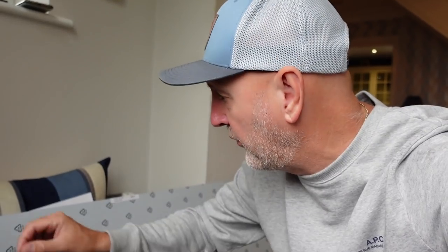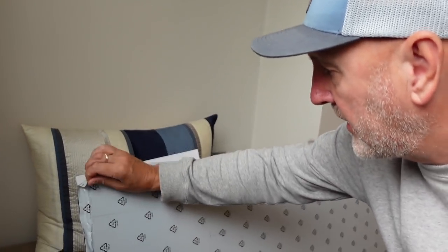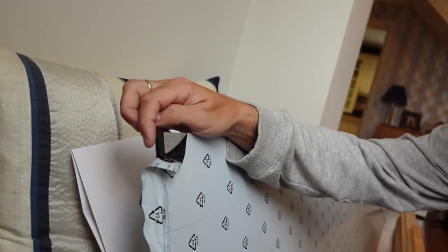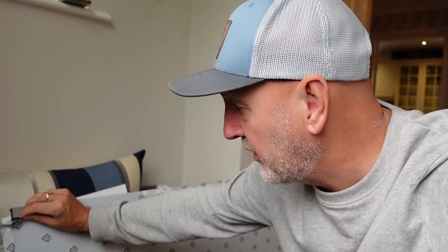It's not a massive big deal, but the worktop is a bit different than normal. What we've gone for is this stuff — it's 12mm thick, it's called compact laminate. In terms of weight it's probably exactly the same as a regular worktop, but it's ultra thin, it looks really cool, there's a great finish — a light grey finish. But this compact laminate, I'm worried that it's going to chip fairly easily. So whilst cutting it is not a big deal, to countersink the hob we've got to drill some holes and that's where we're concerned.